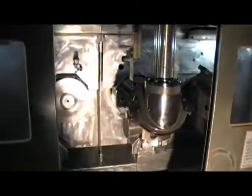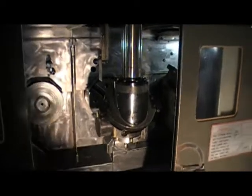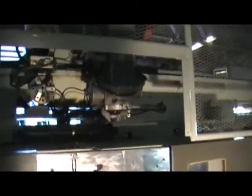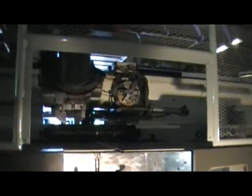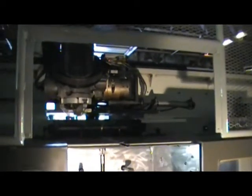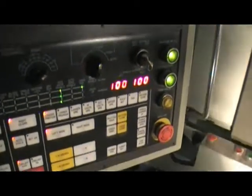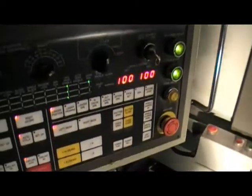I'm going to open up the door so we can take a look at the working machine inside. The gantry loader is very easy to program because all the options are inside the control — all your ready parts, part positions, you can pre-program them and use those pre-programmed values. You get a whole bunch of options for gantry loader operation and you can change the program yourself, setting all the set points like loading and unloading.